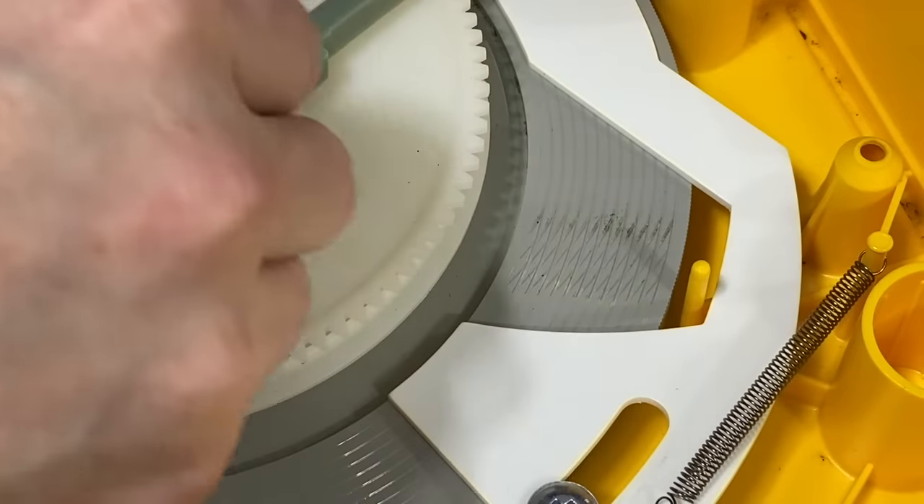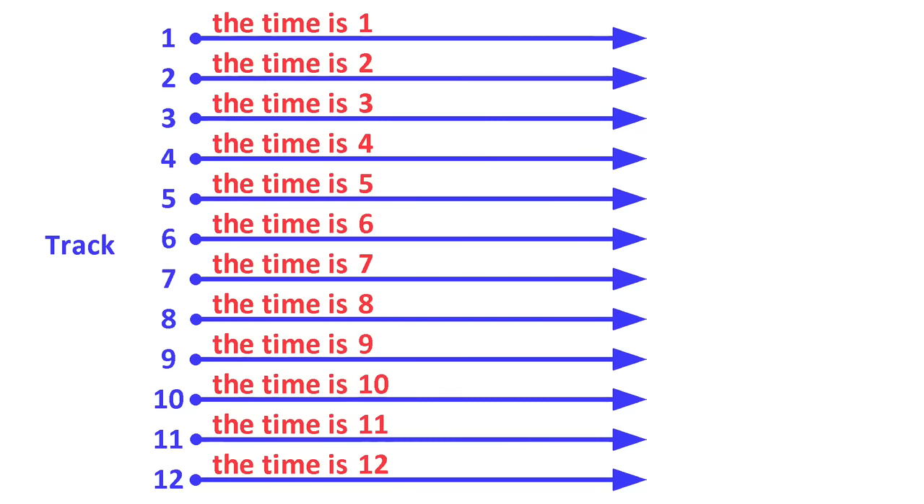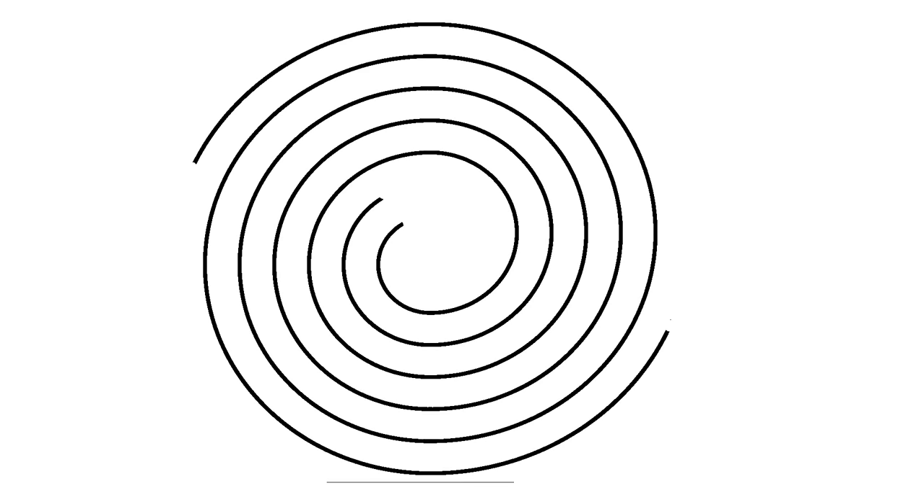If you take a look at the record up close, and if I move the tone arm out of the way, you'll find two sections where there are entry point grooves. But notice there are only 12 of them. I think the way this works is there are 12 tracks which correlate to the 12 hours on the clock. And then the minutes are recorded in 5-minute intervals — so that's the most accuracy you get. You'll never hear this clock say the time is 5:23 or something like that; it always rounds to the nearest 5. I think the different tone arms play different parts of the same track, or possibly there are parallel tracks interleaved in between.